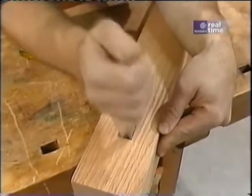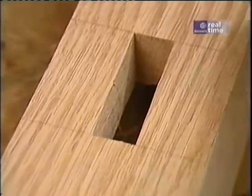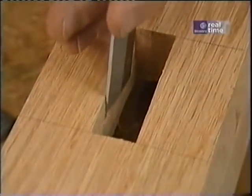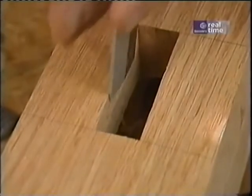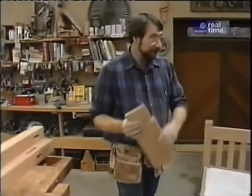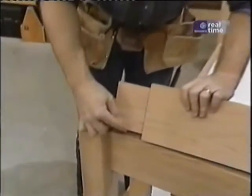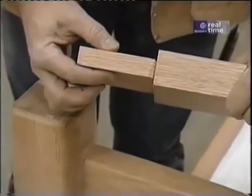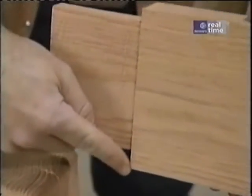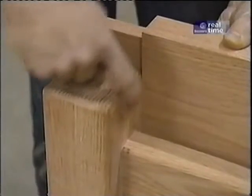The mortising attachment does a real nice job cutting these, but there's always a little bit of irregularity which you can clean up using a rasp or a sharp chisel. That seems to fit pretty snugly. Now what I have here is a sample of the tenons I'm going to be making — I need tenons at all the connections where the rails meet the post. I want to end up with a four-and-a-half inch high by three-quarter inch thick tenon. The most critical cuts are the shoulder cuts along the face and at the top and bottom, because when you slide the tenon into the mortise you want it to fit perfectly tight against the face of the post.